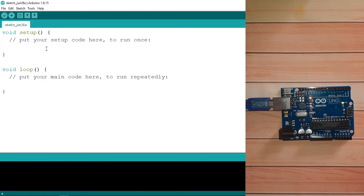To do that, we go to the setup function and define our pin, which is pin 13. This pin is labeled 13 on the board and is connected to the built-in LED. We need to set it as an output so that we can turn it on or off. We use the command pinMode, which is a function. The first parameter is the pin number — 13 — and then we define it as OUTPUT in all capitals. Make sure to end the line with a semicolon.